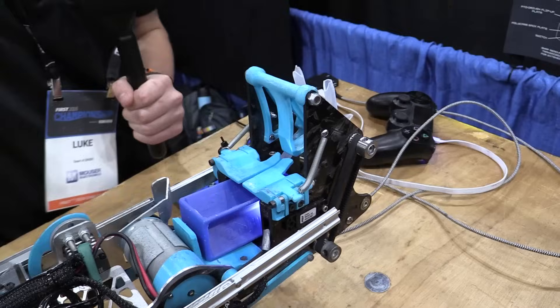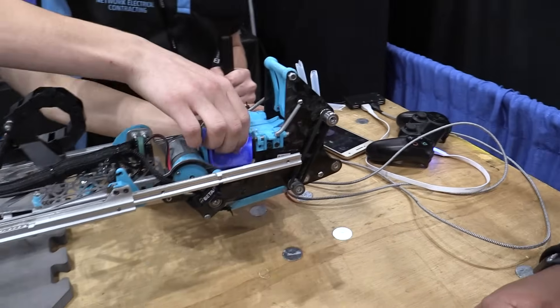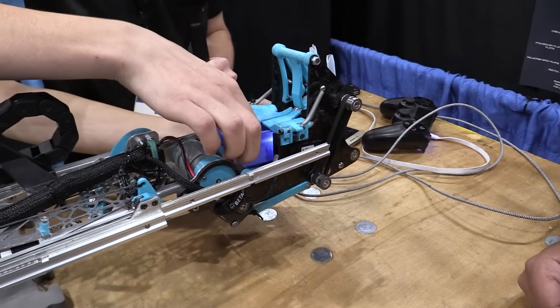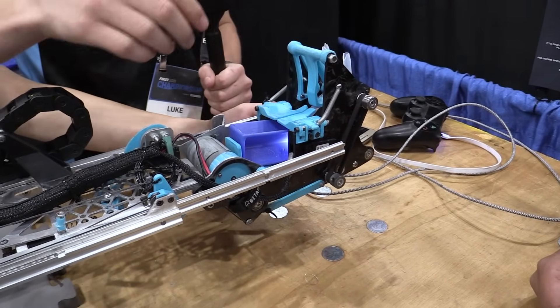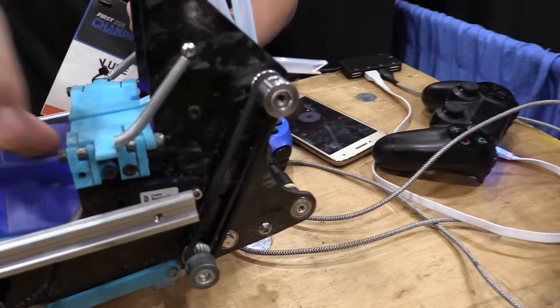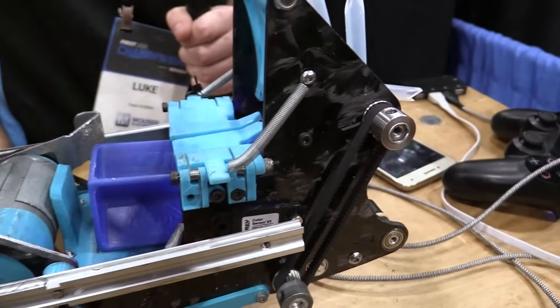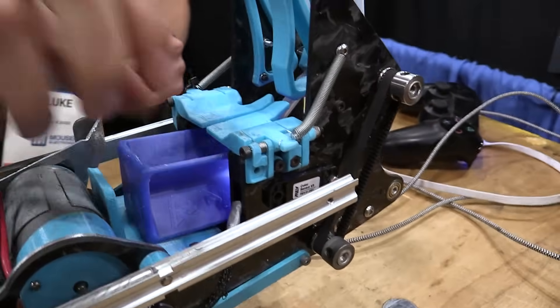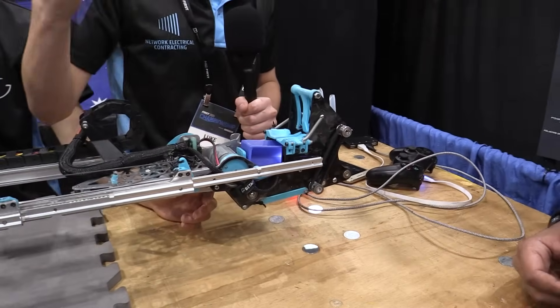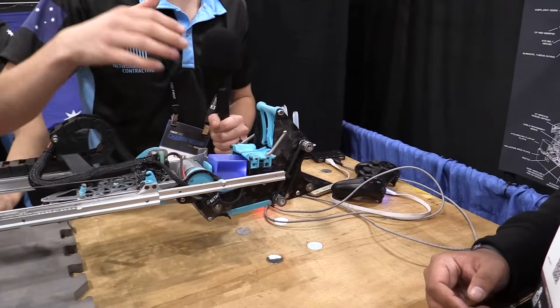For the transfer, our claw will come down and normally picks up — that's why we need these doors. It pulls out the top like that. We've used a few different types of springs here: small springs which add a little bit of force, and then we had to add some larger springs to give it a tiny bit of extra. We can adjust these to tune the transfer depending on how quickly we need it.